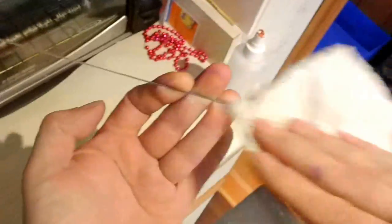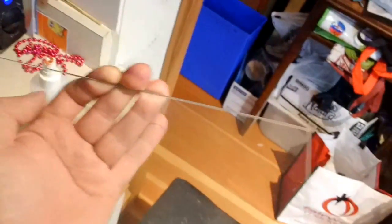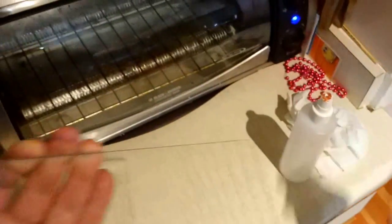I do have a heat spreader on my printer, so that's how I avoid some of the cracking problems you get by using non-tempered glass, by using a 16th inch thick aluminum plate or copper or whatever you want to spread the heat out a little bit better, because I find most of the circuit board based heaters don't do a very good job of spreading the heat.